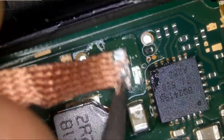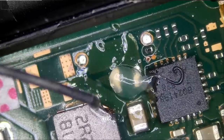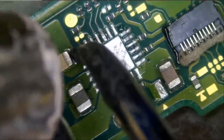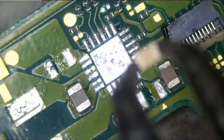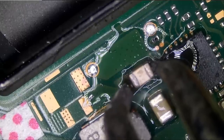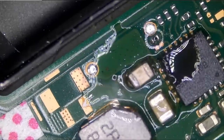We're gonna grab that cap from a donor board. Right here. We have a good looking one right here. But before we do so, let's prep the board. So let's grab the capacitor from this donor board, and this time we're gonna use our hot tweezers along with hot air. And just like that. And we're gonna solder that cap right over here. Beautiful. That's it.